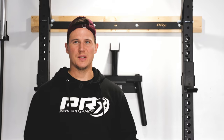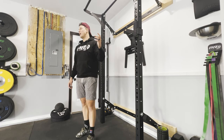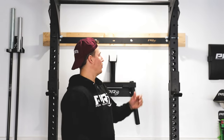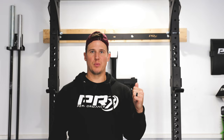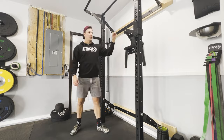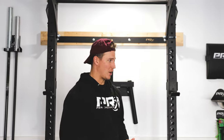To put it simply, a stringer board is a piece of wood that you use to tie a whole bunch of studs together. In my case, we used five studs. We recommend a two-by-six wooden plank — this is going to make it plenty sturdy and give you plenty of real estate to install your wall brackets. You use five-inch screws, drive that stringer board into your studs, and then from there you can mount your wall brackets anywhere on the stringer board. It's perfect for situations where you have odd-spaced studs, or your studs are 24 inches on center, or you just want to center your rack in a tight space.